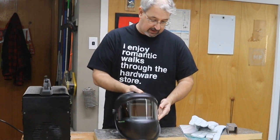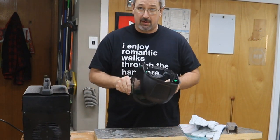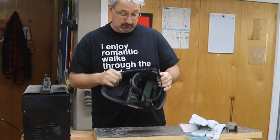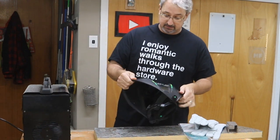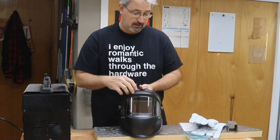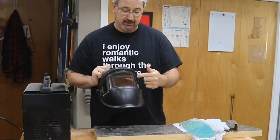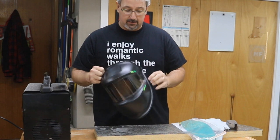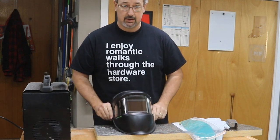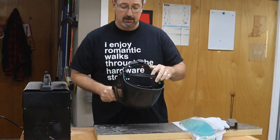The helmet itself is designed nicely. It's a fairly thick plastic, but it is somewhat flexible, so it's not totally rigid — my guess would be something like ABS. The front shade: it gives you five total in the kit, plenty of extras, and that's going to take the brunt of your splatters or anything like that. On the two sides there are two shaded areas where it gives you some peripheral vision while you have the mask on, and that is super nice. And again, auto-darkening on the shade itself.